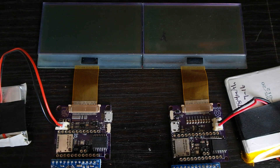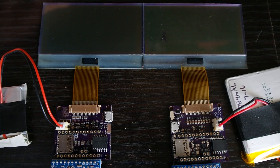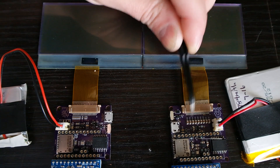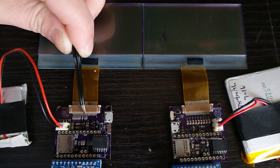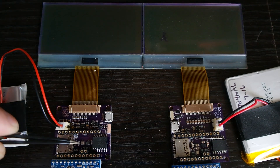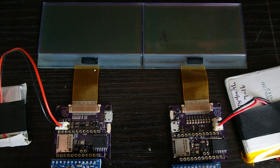I've got the older version, version 1.01 on the right-hand side, and the newer version, 1.02 on the left side. The easiest way to tell the difference is looking at the capacitors for the LCDs, for the charge pump. On the old version they're 0805 packages, on the left side they are 0402s. This is what I needed the pick and place for because they're so small, but it takes up a lot less space. Underneath the Pro Mini you can see it's a lot less crowded. This was a major rework when it comes to design.